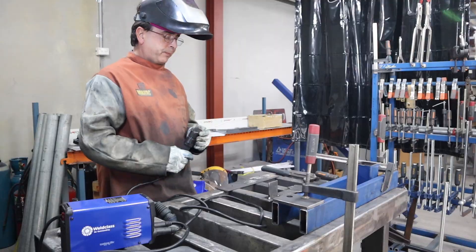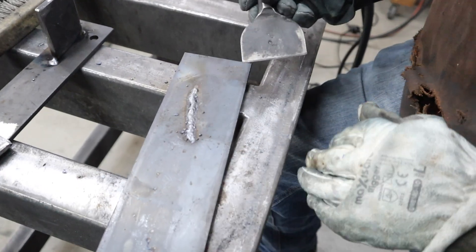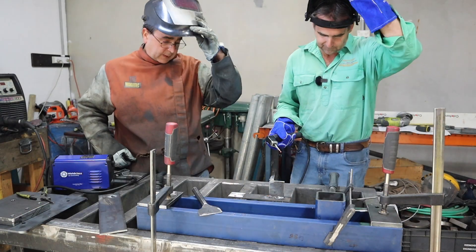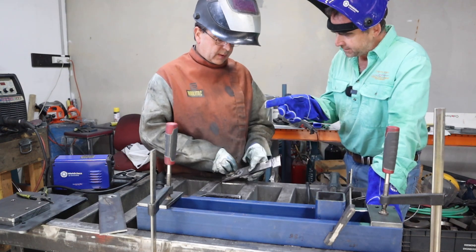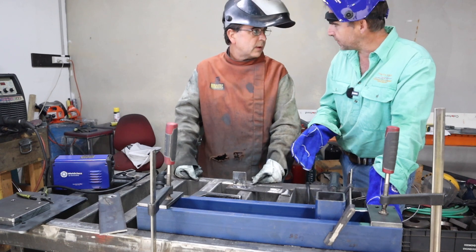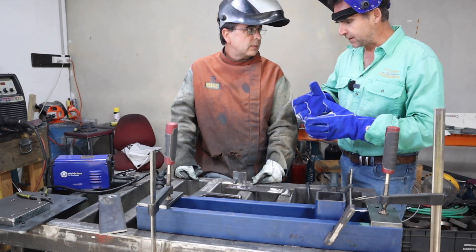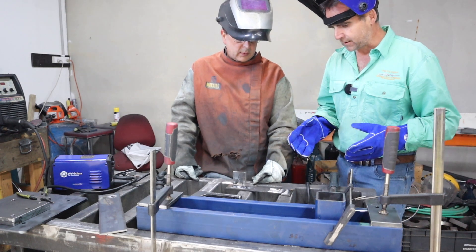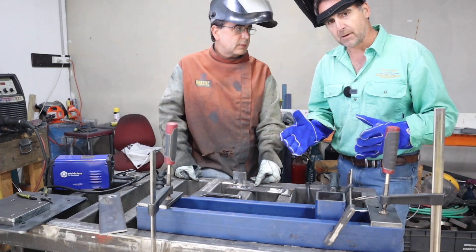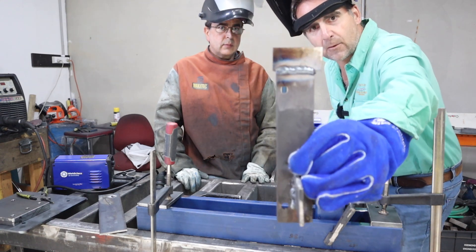There's nothing wrong with that at all — I'll have one actually. Do you want to try it? So we're going to try and do a couple of little fancy welds here. Push it in a bit harder. It's not bad for a first crank. What I like about this machine is the hot start option — we've got it on about number five, so about halfway. For me, getting the initial arc going with an arc welder is always a lot more difficult than for someone used to this job. I just can't emphasise enough how important it is to have someone that knows what they're doing over your shoulder. If you know a good welder, don't be afraid to say 'I'm a pretty rubbish welder and I want to get better — can you have a look over my shoulder?' Do it every couple of months and you get better. And for a rank amateur welder, I'm pretty happy with that. Steve, thank you very much mate — appreciate the mentoring as always.